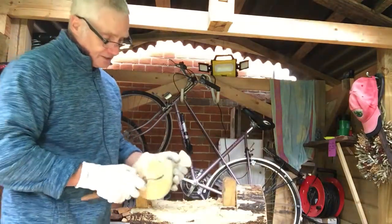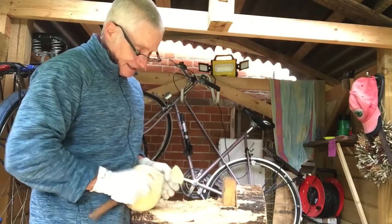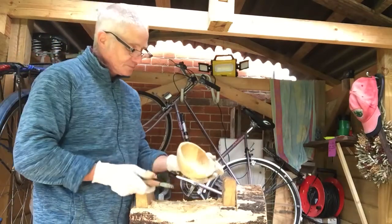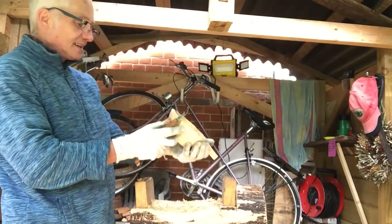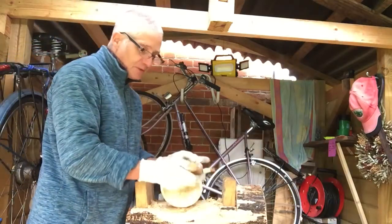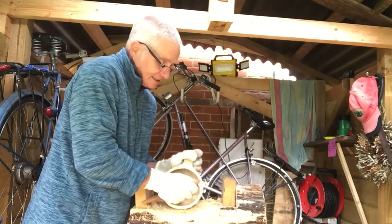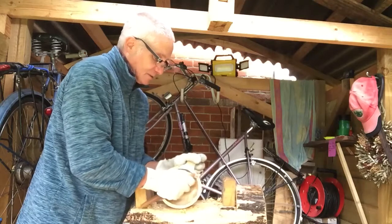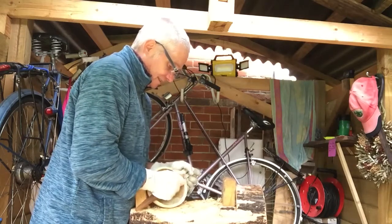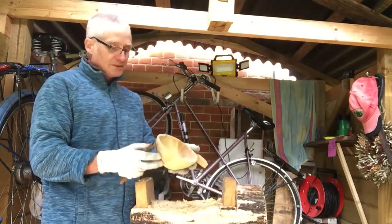The other thing, as I said, is the base. Again, it's just reaming it flat, trying to get it flat to match the upper edge of your Kuksa. And on the top, it's really then a case of getting that very wobbly top edge straight. And with the large, long handle of the kuksa, you can just sit it on the bowl like that and use it really to keep the blade straight as you go around and do your cleanup. So it's a great way of cleaning up the top edge of your Kuksa.